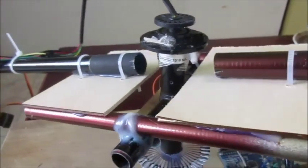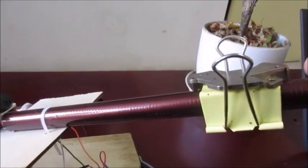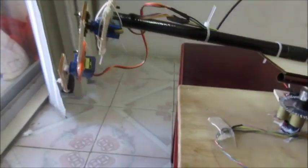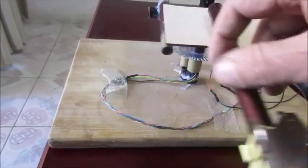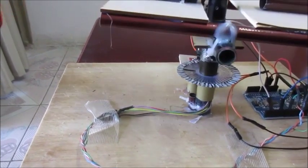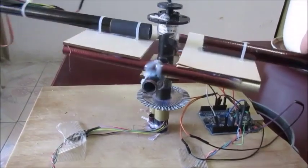On the top I've got this slip ring that provides power to the servos without worrying about the wires twisting. I've got a counterweight back here — it's just a big magnet I slide back and forth on this paper clip. I took the arm off my old crawling robot project, so it's just two servos and an Arduino Uno. It works pretty good. I've got a few improvements I want to make, but mostly changing the software, and that's it.